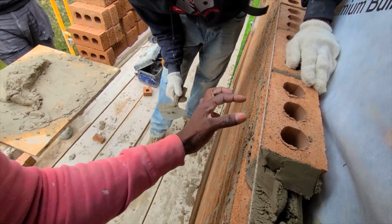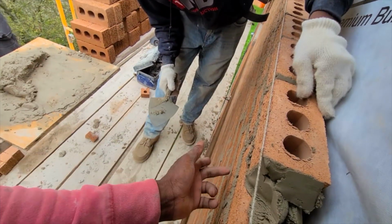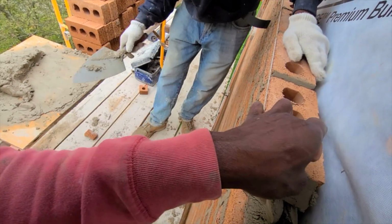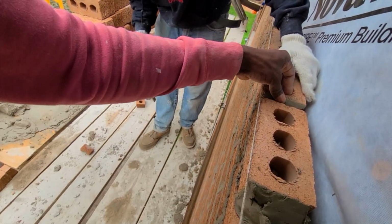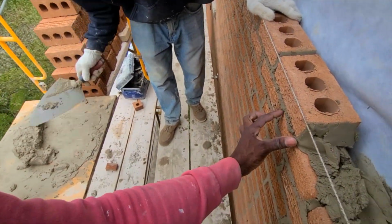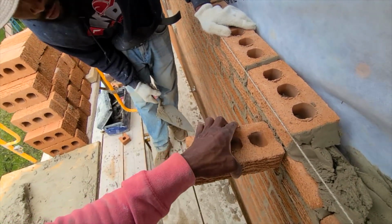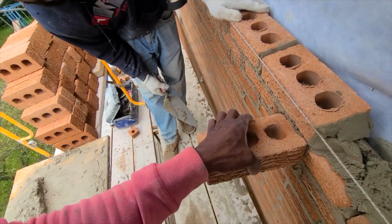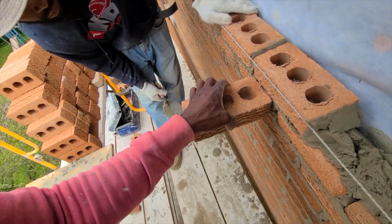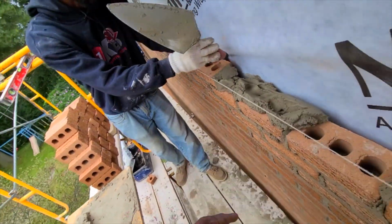So you see right there, this is bigger than this. This is a size brick here. It may come from down here still, because you're depending on the band, but eventually I will take time and try to squeeze it over more. You're supposed to have the same space, a header at all times. So if you put a brick like this, it's supposed to line up with the header of this one here. So just bear that in mind.